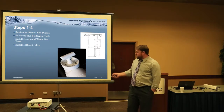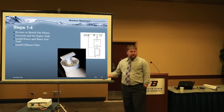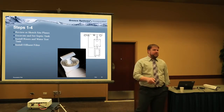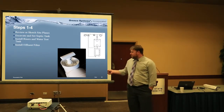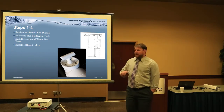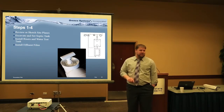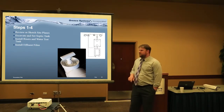The key point here is the effluent filters for the RTs. You see the slots in the top? That is a vented effluent filter. You want to be sure you've got that. If you don't have the slots, the unit doesn't vent and we're not happy. If for some reason you don't see the slots, just let us know — we can send you out a cartridge. Easy, not a problem.